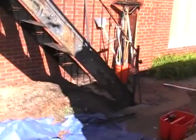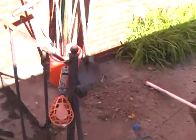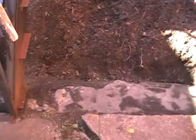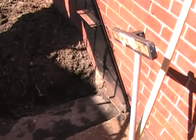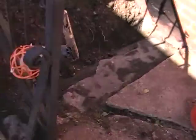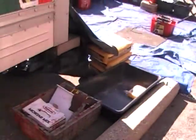As you can see, we have a pretty good setup going. We have some excavation going on over here where we took out the bottom step and we'll be forming this up and cutting concrete down. We took the bottom step out that was actually below grade. So we removed that, and we will encase the stringers in concrete. We're all set up with a little cement station and excavating.